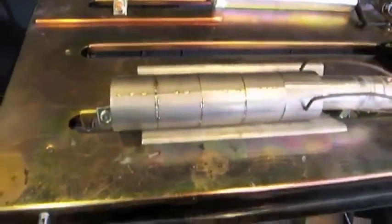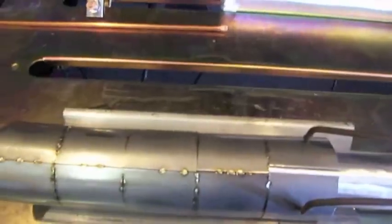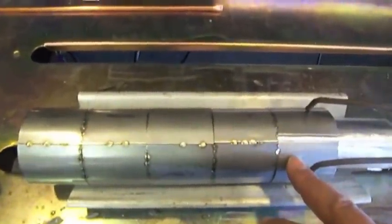What we've got here is five pieces of 16-gauge rolled 304 stainless steel. The fifth one must have been shorter or something, because in order to fit up it's got about a quarter-inch gap in it. So what do we do with that? Ideally we could take the ends of this thing and purge the whole thing out and get a purge on the back side, but that gap is going to give us fits no matter what.